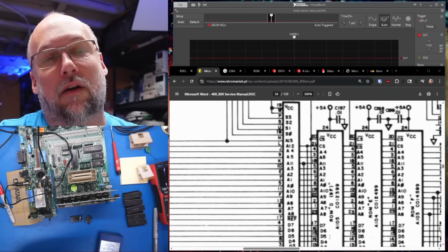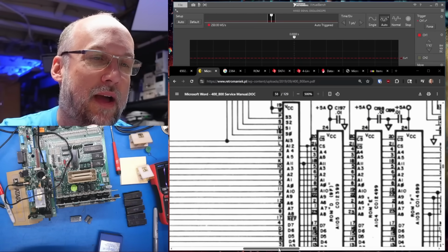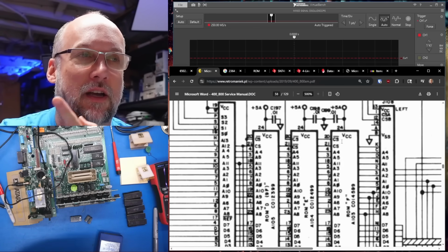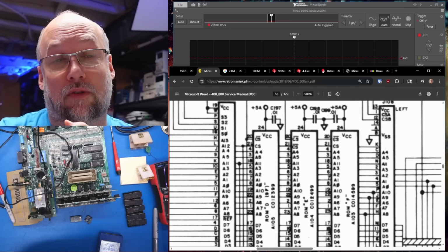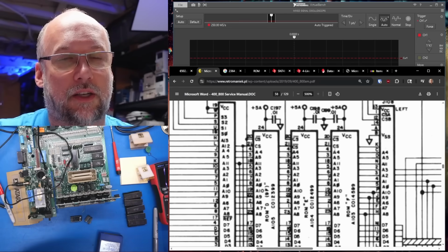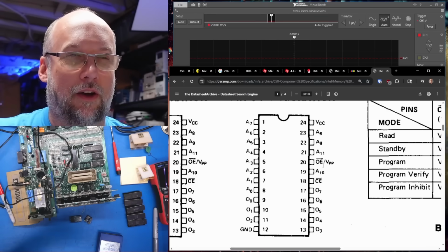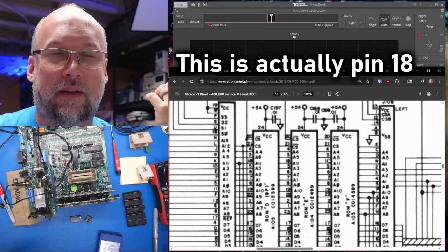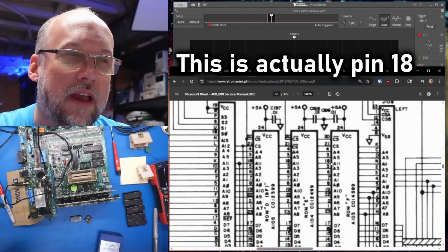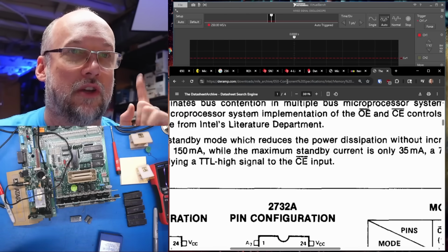Okay, so normally you'd say, oh, we'll just put in an EPROM and replace it. But the issue is this chip, the one that's bad, it's this one all the way on the right side. It's got chip select low and chip select high. Well, on EPROMs, that's a problem because if we look at the same size EPROM as this, a 2732, it has 2 chip enable lines. We have output enable that needs to be low, and we have chip enable that needs to be low as well. Not to mention address line 11 is hooked up to pin 21, while address line 11 on the original chip is hooked up to pin 10, it looks like. And pin 10 is one of the data lines. So a 2732, not a good fit.